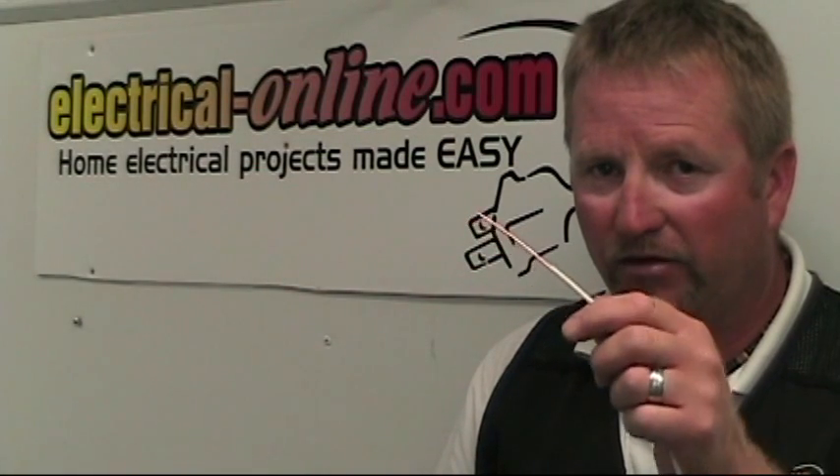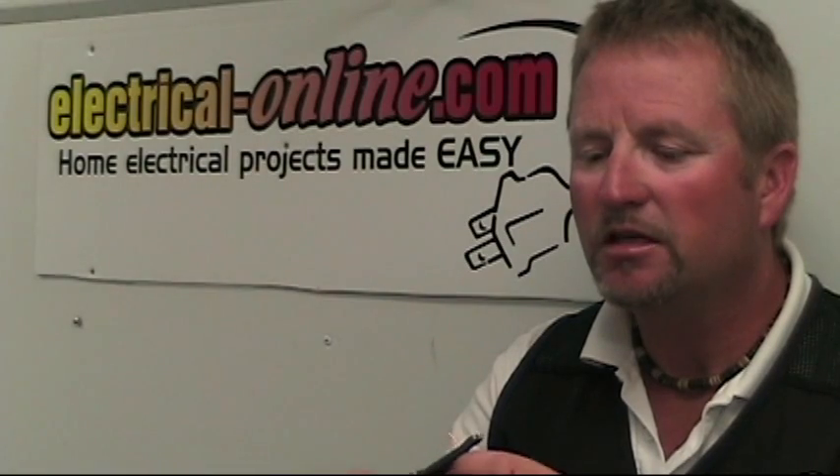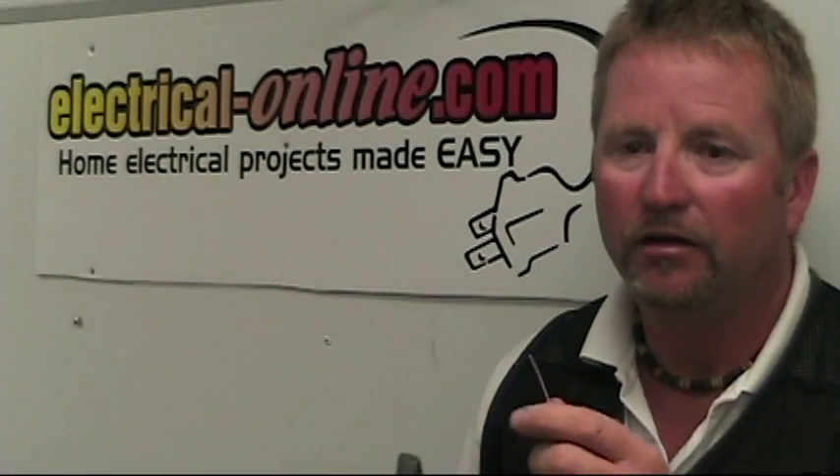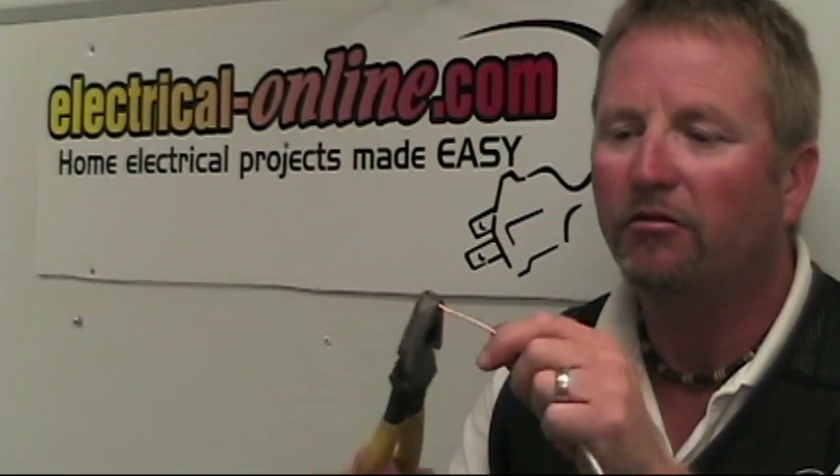This is smooth — I haven't nicked it whatsoever. But let's say I did, and I used the wrong gauge on the stripper and just made a little bit of a nick in the wire. I don't know if you can even see that, but it's barely made a nick in it. Well, you make your splice and you bend it back and forth a few times in the box, tuck it into the back of the box — before you know it, right where you nicked it, that wire is going to break eventually.